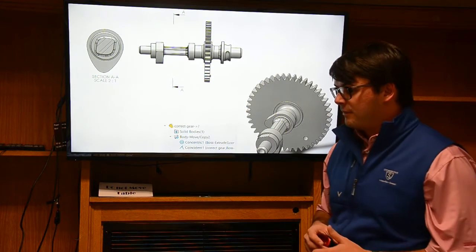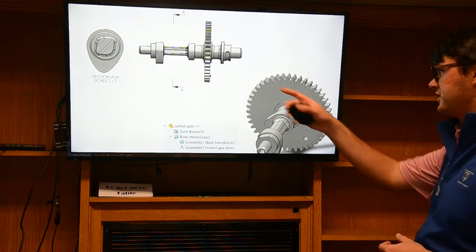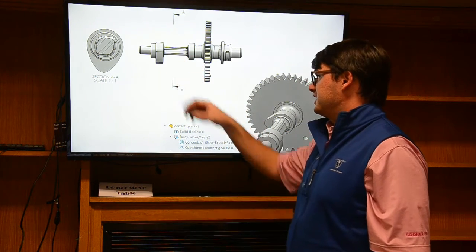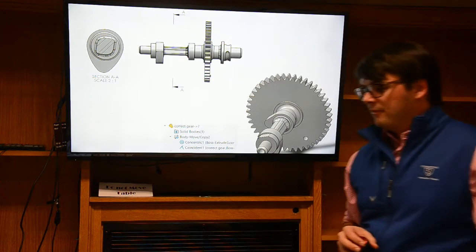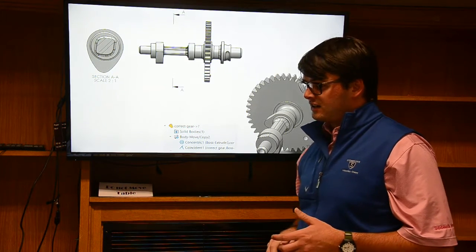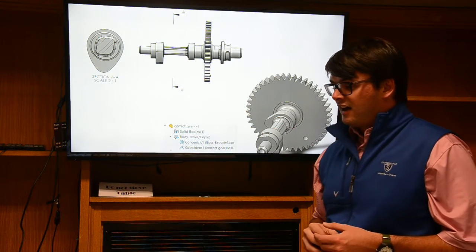For instance, the biggest thing that's noticeable, because it was made in one piece, is if you look up here at section AA, some of these straighter parts that don't have these curves to them, especially this section here, have some pretty crazy draft angles that were pretty hard to replicate. In particular, it made it very difficult to measure with all the fillets that are around the radius there. And they also differ in length along that.